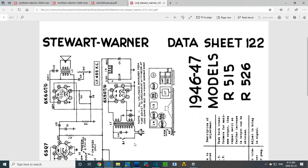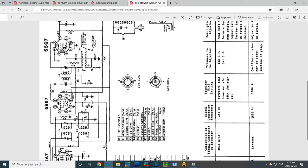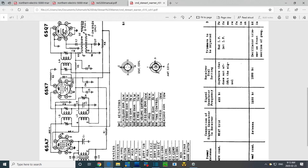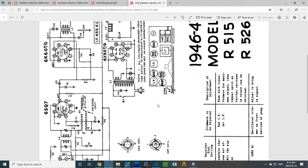Oh, chassis. How is the chassis dealt with? So the entire radio is isolated by this transformer from the power system. The negatives of the filter capacitors are right onto the chassis, assuming this is the chassis symbol, which I'm pretty sure it is. All over the place the chassis is used in this radio. So there's no separate B minus wire as such. Okay, now we're ready.